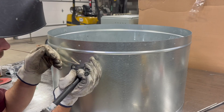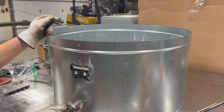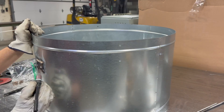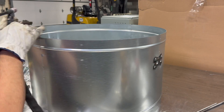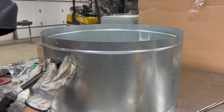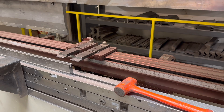To get the bearings and the plates set, I go ahead and put in the rods that the dampers will be welded to. That way when they're put in there and you clamp those plates, you know it's going to be straight — no binding. Then pull the rods out and get it welded up.